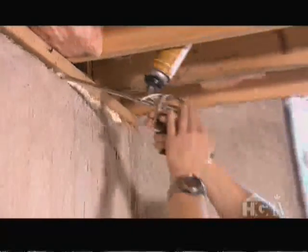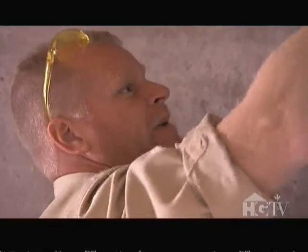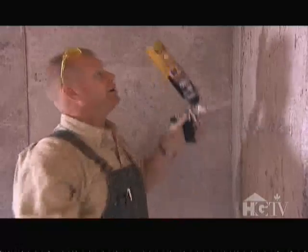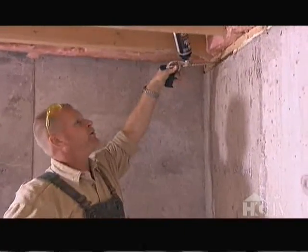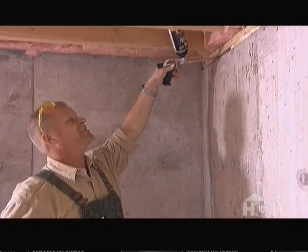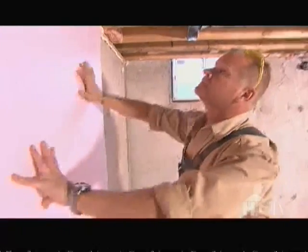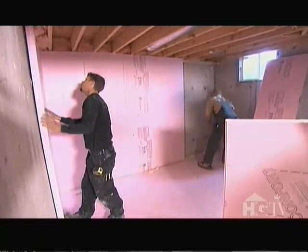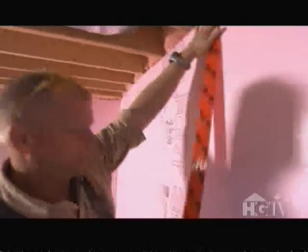We're going to come right up to the floor joists. To give an example of how we get moisture in our walls: using batt insulation with a six-mil vapor barrier, if you have one pinhole in that plastic, that pinhole can allow a couple of cups of water in a season. If you're going to make it airtight, you better make it airtight.